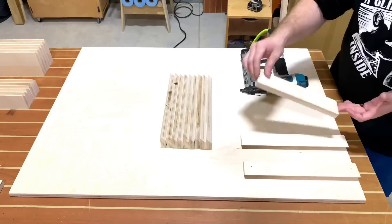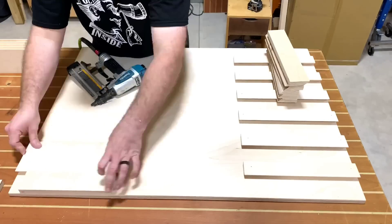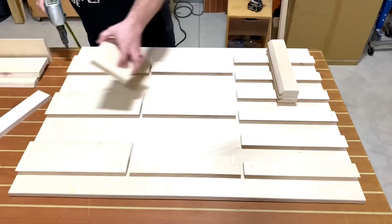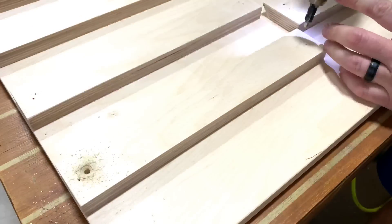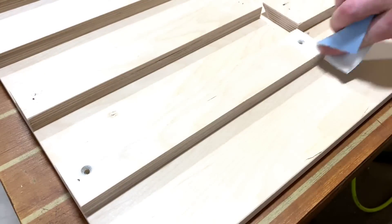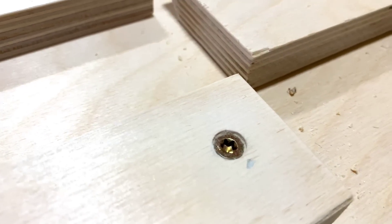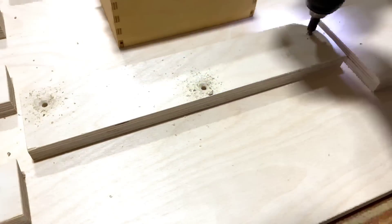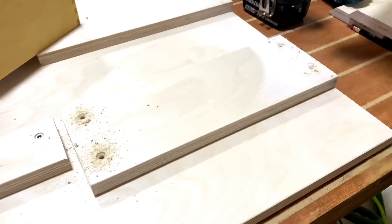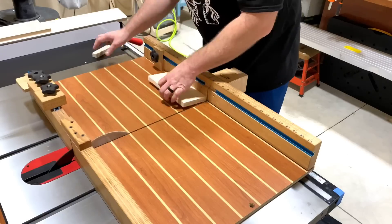I'm building a makeshift cleat wall to illustrate the three types of cleats we'll discuss. On your right are the very tightly spaced cleats. On your left are the very large cleats, but moderately spaced. In the middle are your medium size, also moderately spaced. To attach the cleats to the wall, I always use just brads and screws — no glue. On the small cleat I'm using two screws parallel to each other. On the medium I alternate the screws up and down, staggered. On the larger cleat I install two screws about three inches apart, directly one on top of the other.